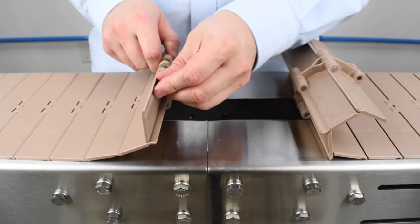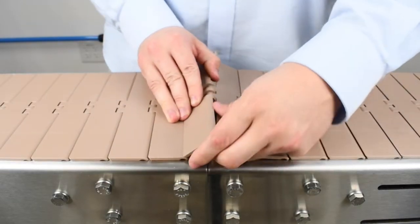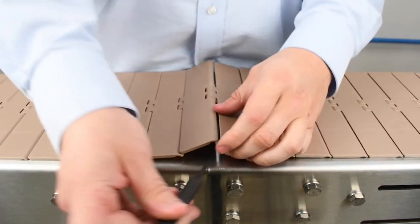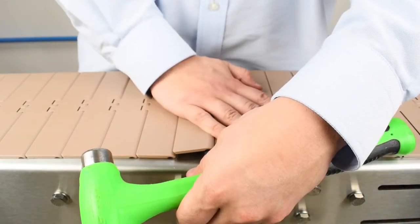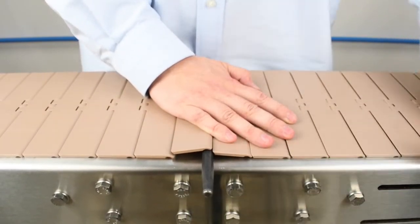Make sure you are driving the smooth end of the pin into the belt, as driving the knurled end could damage the tabs. Link the tabs together and push the pin through the first few tabs by hand. This should loosely hold the ends of the belt together while you align the punch against the knurled end of the pin. Firmly push down on the belt with your hand to hold the punch and belt in place while you carefully and firmly hammer the pin back into place.